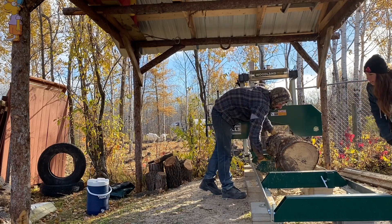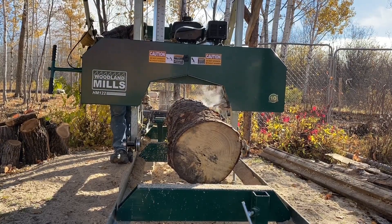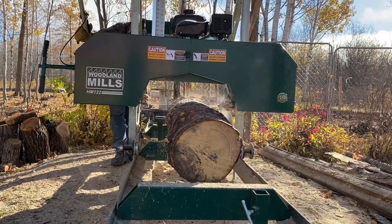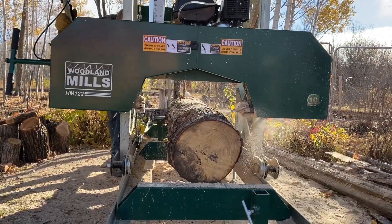You're going to have to take off a couple of shavings to be able to get down to that. The important thing to remember here is just let the blade do all the work. Take your time with your cuts, and you'll see when you have to cut a little bit slower when you're cutting through knots.